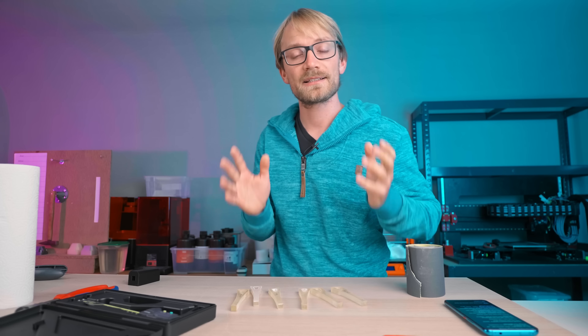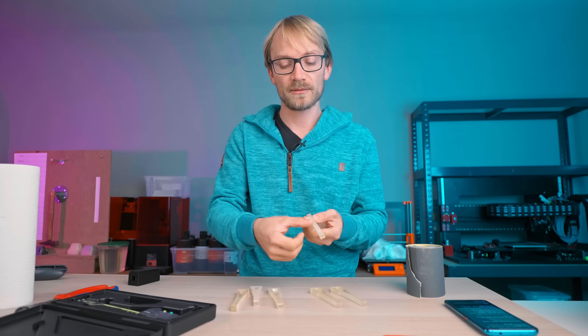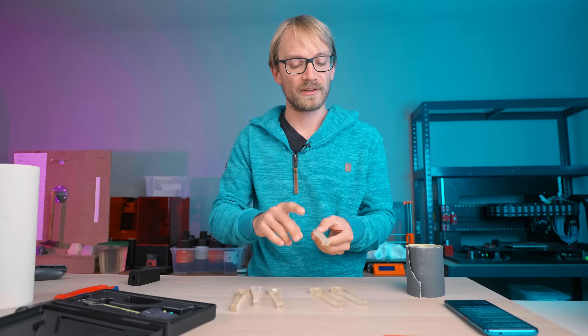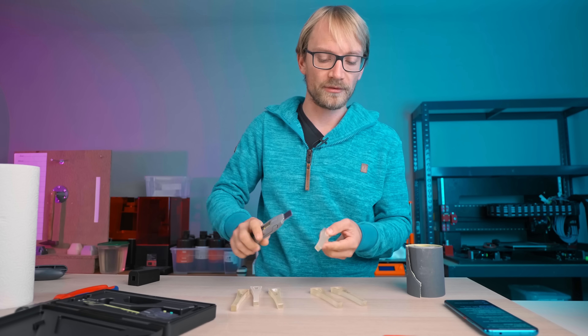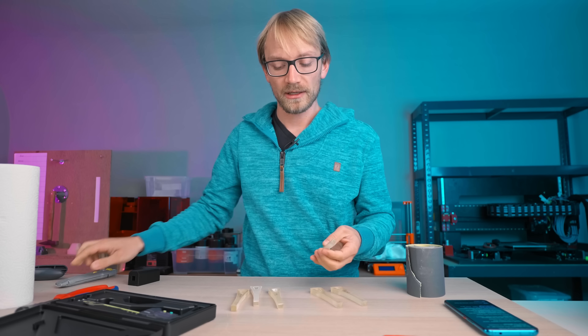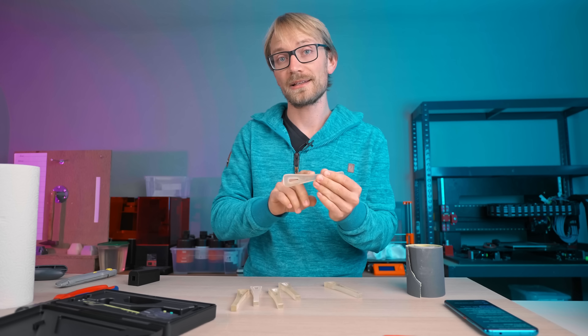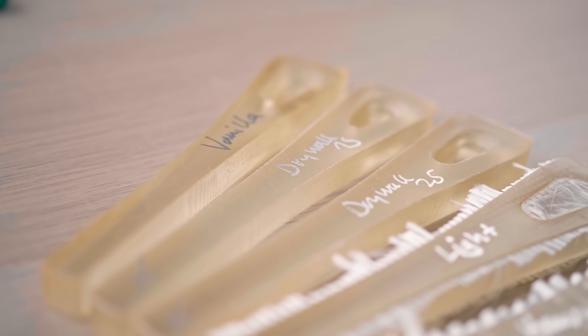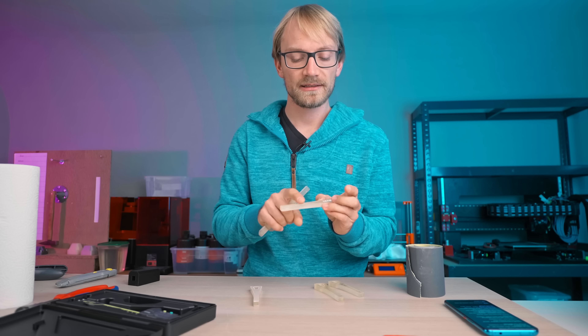Here's all the parts done. I just gave them a light sanding to clean up all the edges where the fibers were still sticking out and where I got some rough edges from cutting off the fibers with a knife. Sanding of fibers works a lot better than taking a knife and trying to grind them off. These parts are very smooth — on some of these you can even barely see that there's any fiber in it. If you take the one where I used the drywall paper or drywall glass fiber, this looks nearly identical to the one that doesn't have anything in it. And even with the heavier cloth-type material, you can see that the light refracts slightly differently and that there's a bit of glossiness in the surface, but really it's not that visible at all.